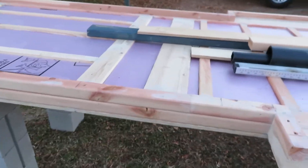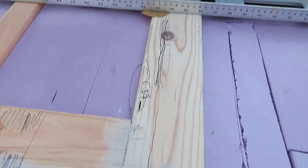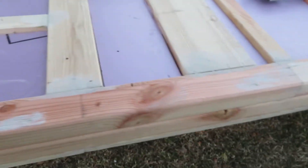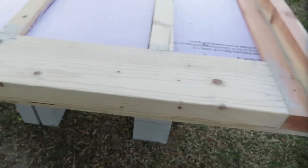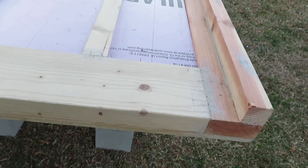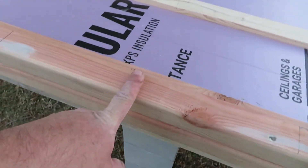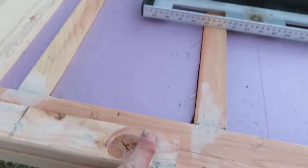The gray tank will come to that right here as it's marked. That is liquid nails, corrugated staples, and screws. This left-out centerpiece is going to be a two by four between the sleeper and the actual refrigerator. Washer and dryer would go right in here somewhere — it's going to be 24 to 30 inches, 27 is what I figured by the measurements online.